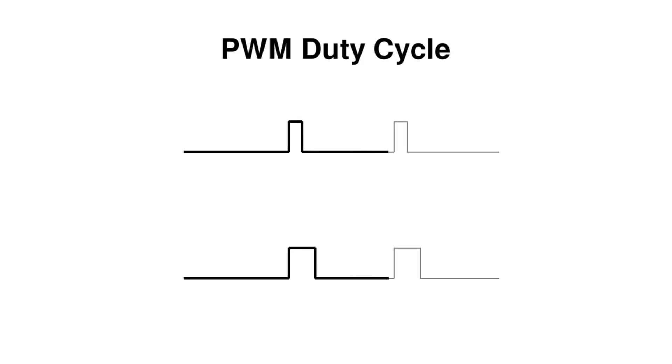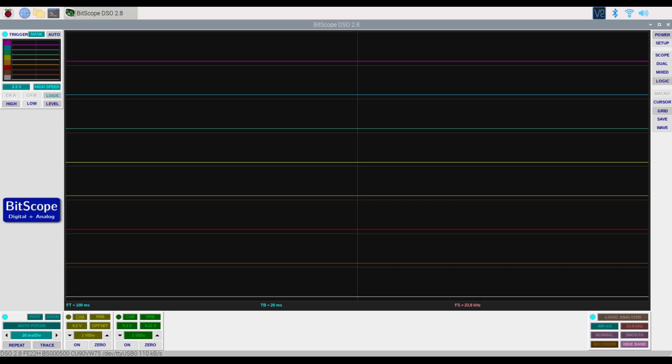This is the theory, but I wanted to actually test this before wiring up the Pico. My next step is to connect the receiver to a digital signal analyzer and then an oscilloscope so I can check the actual values of the signals. I'm going to use my BitScope to look at the waveforms in detail. I'm particularly concerned that the receiver runs at five volts, so I need to make sure that the signals can be safely connected to the Pico without risk of damage.